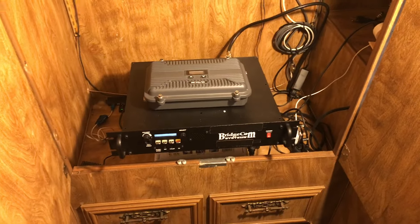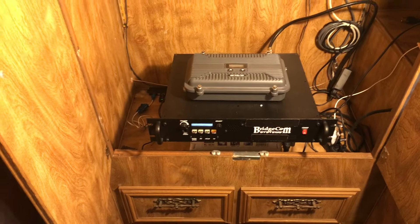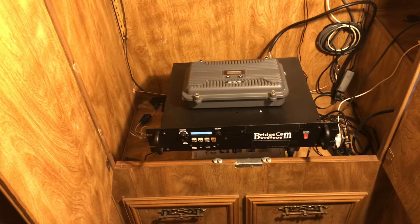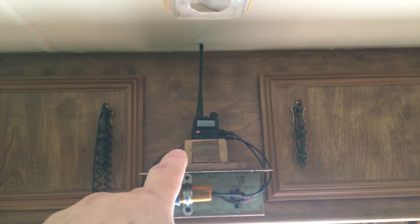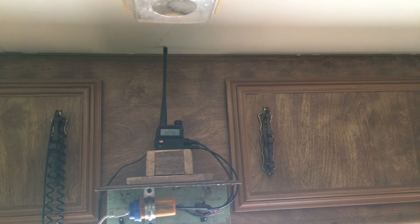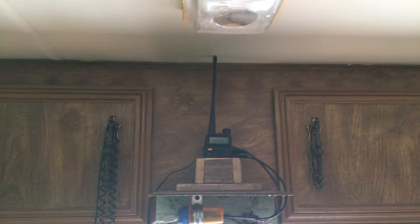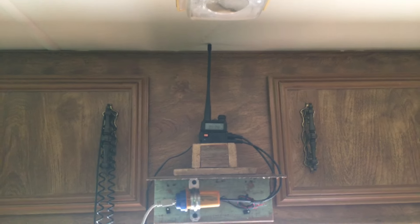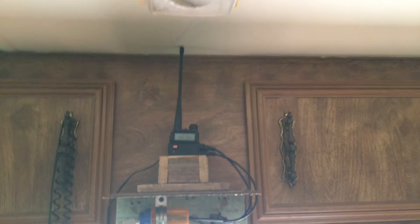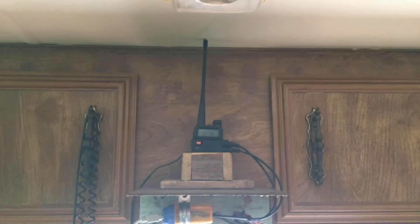For that little bit of frequency difference, I don't think it's going to make that much of a difference in receiving. I'm also going to be running a simplex repeater, which is going to be the exact same setup as before. It's about 12 feet away from the repeater room. That is a handheld programmed to repeater frequency, and it will record and playback all my activity when I key up a radio. We're going to compare the S readings and how the sound sounds. My mobile radio does have an S meter and I will be zooming in on that. You'll also hear the audio. I'll post that video link in the description below if you want to see part one.